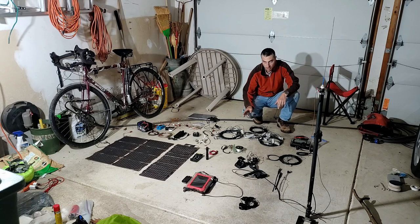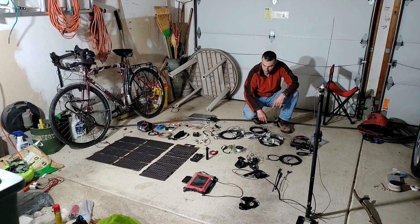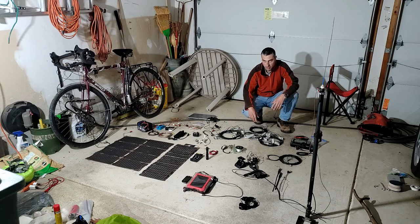So I have the option of, depending on which jumper I set, I can set it for either the high side of the band or the low side when you get down to 80 and 40. At some point, this particular antenna, I'm going to expand out to 160 meters also. I haven't decided if I want to split that band into two sections or three sections, but when I get to it, I'll cross that bridge when I get there.